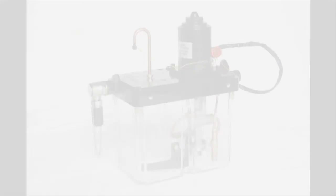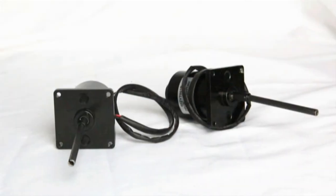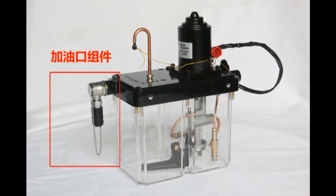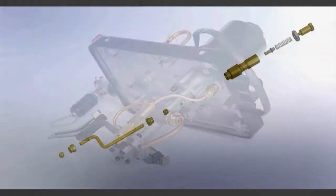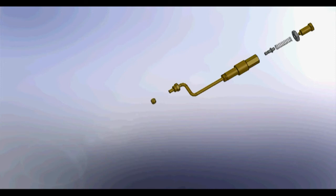The low-power DC motor operates at a low speed. The external gear pump pumps the grease through gear meshing and separating. The grease filling unit is rotatable for greasing during operation. The safety valve is constructed with a sliding valve structure, consisting of a valve core and spring inside, featuring simple structure and stable performance.